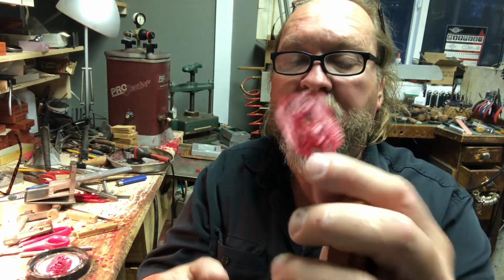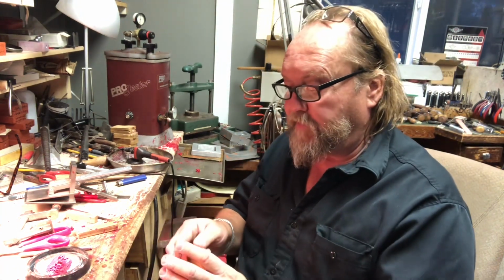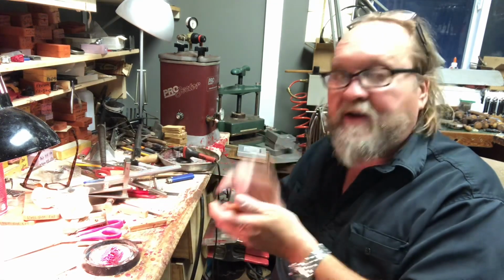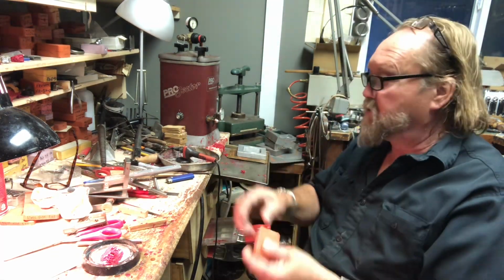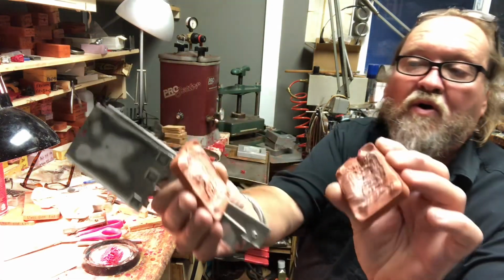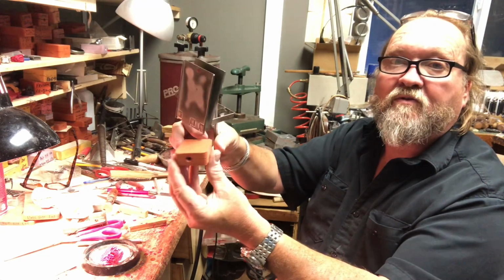Right? And there's no problems on it at all. There's a little bit of discoloration in the wax, but that has nothing to do with the quality of the wax. You can see that. That's perfect. So, what I did was I just put a little talcum powder on it. I'd pushed the vent holes through it and all that already. So just line it up nicely. It lines up on its own anyways, right? The tabs are all identical and this only can go one way. It literally just drops in, right?